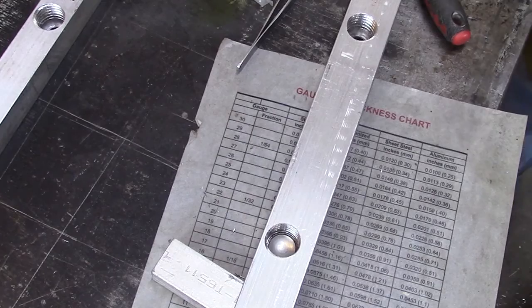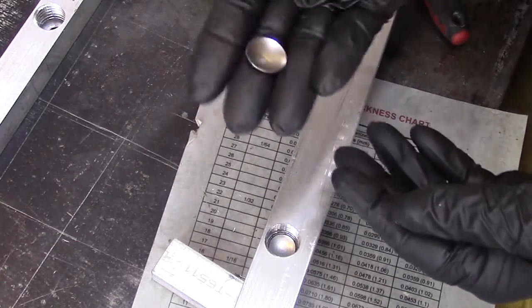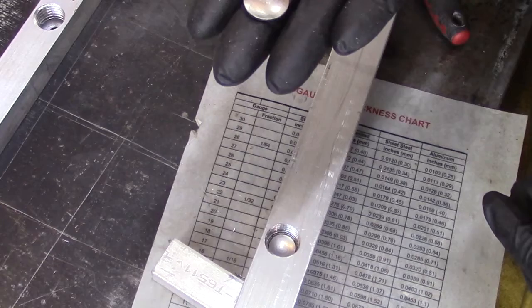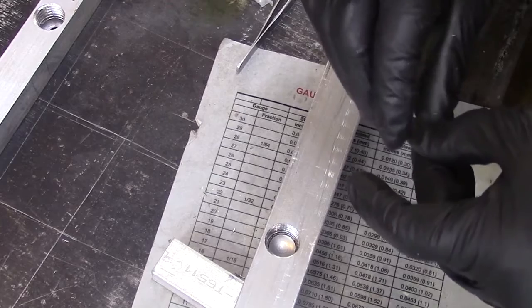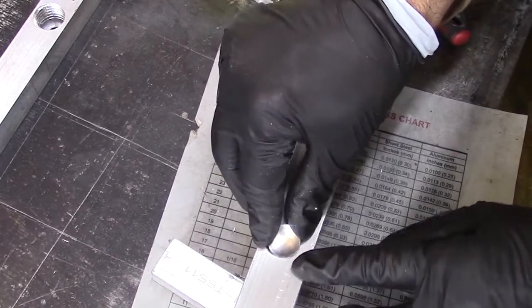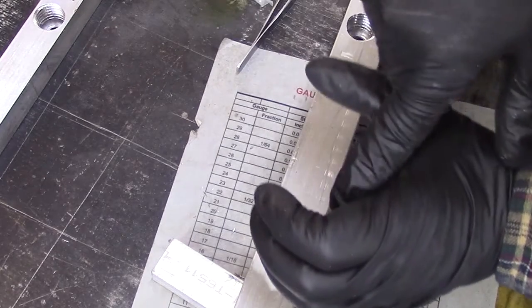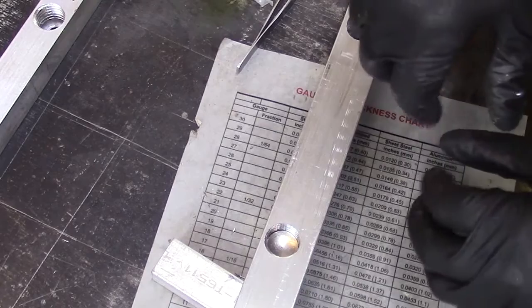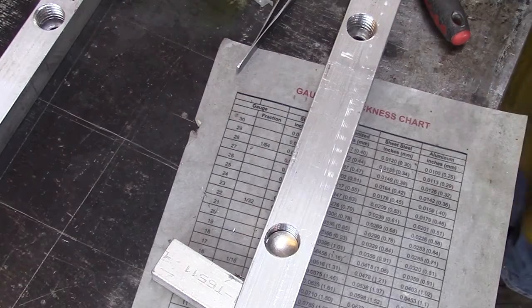Now the next step is to put our larger cap in. And again, this is no more than a freeze plug, but it's a 3/4 diameter. We'll set it the same direction down into the housing. And what it'll do is push down against that other cap. And then we'll have an adjustment nut, which we'll next install.